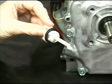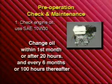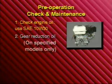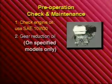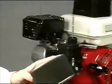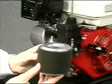Refer to the owner's manual or call us at the factory. For maintenance, change oil within the first month or after the first 20 hours of use and every six months or 100 hours thereafter. Second, check the gear reduction oil before each use. Third, the air cleaner — check before each use to make sure all components are in place, are clean, and are in good working condition. Clean and replace, if needed, every six months or 100 hours.